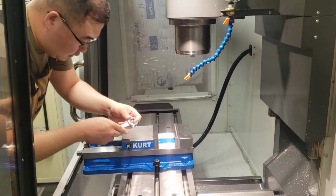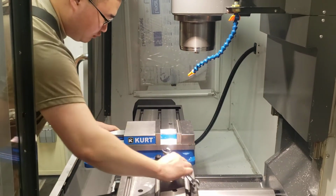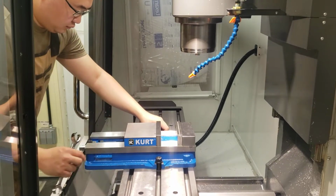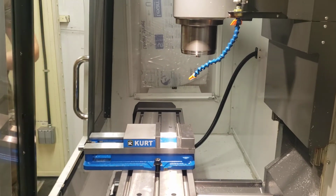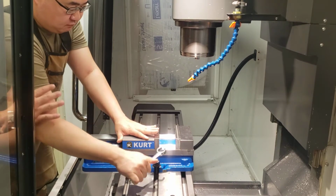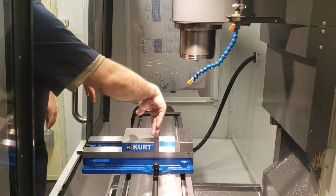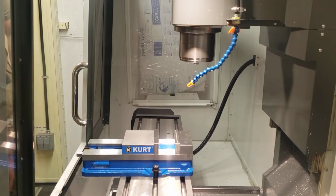What size is that bolt? 7/8. 7/8 is the size of the nuts for the vise. Take notes. The first bolt, one side you're going to tighten nice and tight, one side only. The other side, you're just going to snug, because when you come down and do the lateral, you're going to have to hit it with a tap and then close it, tighten it. You good? Alright.